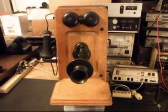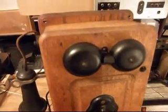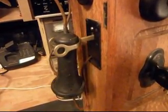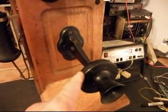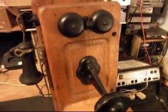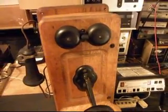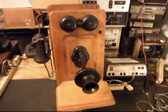Okay, we're back now, and we are finished up with this telephone. I want to show you first of all the corner that was broken up top on this left corner, and that has been repaired. We also installed a new receiver inside the receiver capsule. We went through and put a new microphone in the transmitter here. We installed a bell clapper cover, so that's been taken care of. And the telephone was totally rewired the way we need it to work.